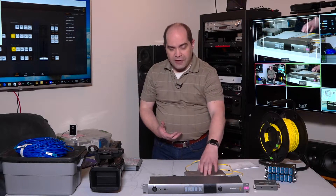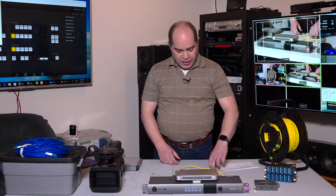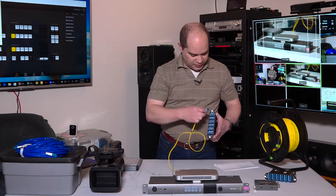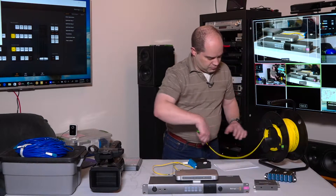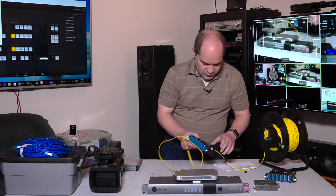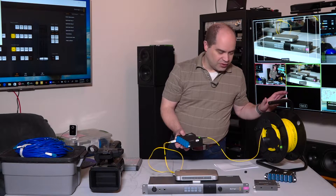That summarizes the Blackmagic Optical products I actually own. Because Blackmagic Design uses industry standards for connection types and signaling, you can interface with other products as well. I've invested in these fiber cassettes — each one takes up to 12 duplex connections and snaps right in. On the back they have MPO or MTP connections, which connect to cable that sends 12 video signals over one single cable. This reel is actually 150 meters — nearly 500 feet.